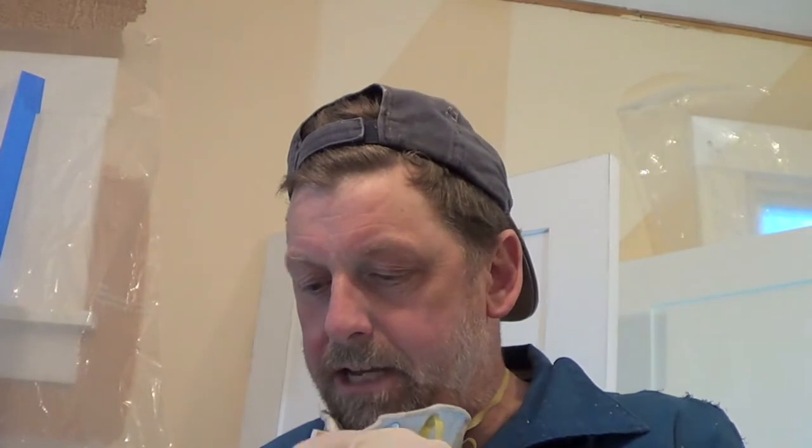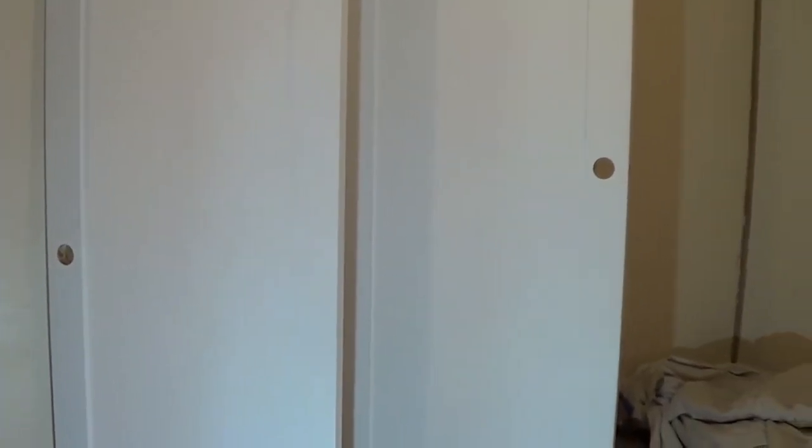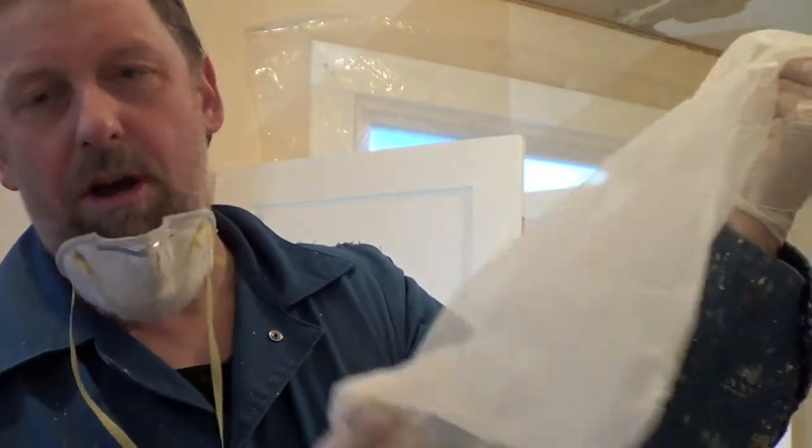On this edition of My Old House painting doors, I've mixed up the latex paint. When doing latex paint, I find any paint comes way too thick, so I dilute it just slightly with water — in this case I made it a lot runnier. One of the main keys when spraying: after mixing the paint, I run all the paint through a strainer as I put it in the gun. That way you know you have no particles in there. The strainer is a mesh net — you put it in the cup of the sprayer and pour the paint right through it.